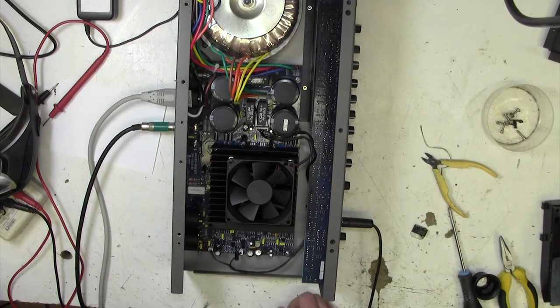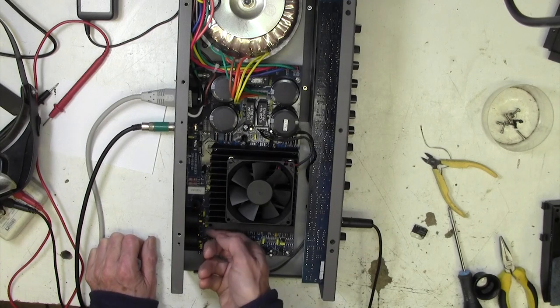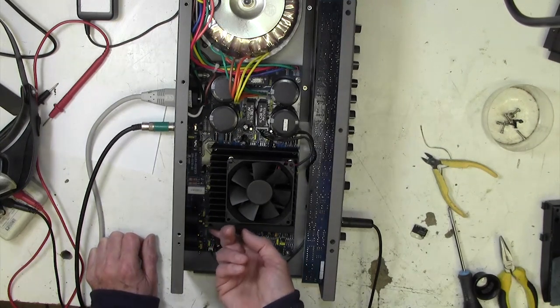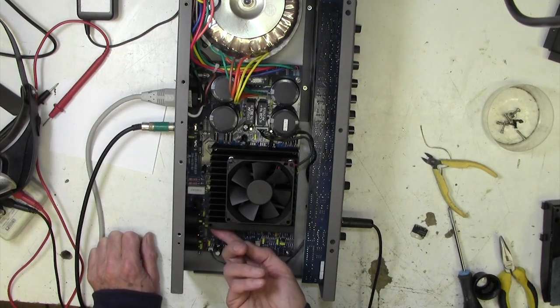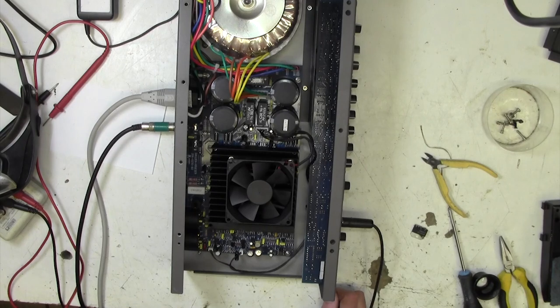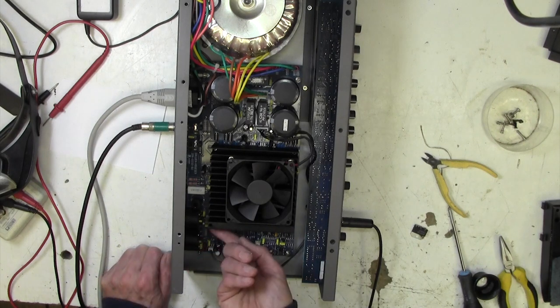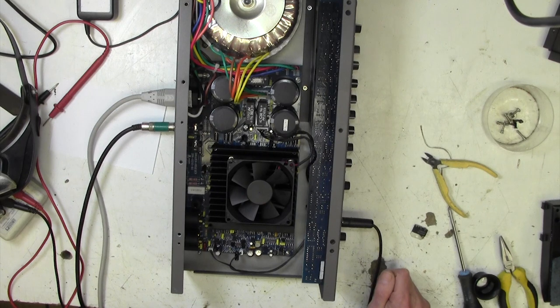I don't like chips mysteriously blowing up for no reason. Yeah, if you'd been thrashing it at the time on a gig or something, then yeah, I could believe it. That's just couldn't handle the power going to the tweeters. But he was just sitting there working on his computer. And suddenly, the thing went up in a puff of smoke. It wasn't even using the amp. Yeah, that's okay. Well, I'm confident enough to go a bit higher. Say 120 volts in. Nothing untoward happening there. That seems all right. Go up a bit higher. 150 volts going in.